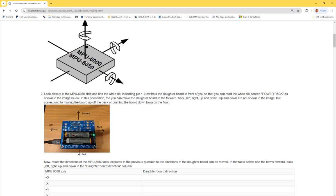Whenever it moves, it's actually a very little mechanical system inside the chip, at the micro nanometer level, moving around. When it moves, it changes the capacitance, and that capacitance change will be digitized by a CDC, a capacitance to digital converter. So eventually we get the data out. You can see how small that little chip is. It's amazing. It's able to directly output an I2C signal, which is a standard communication protocol. A little bit more complicated than UART, but similar, just serial: one wire for data, one wire for clock.